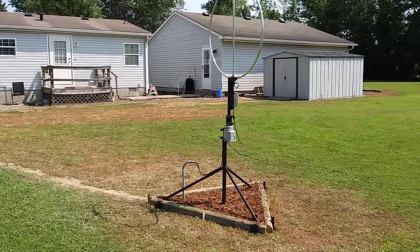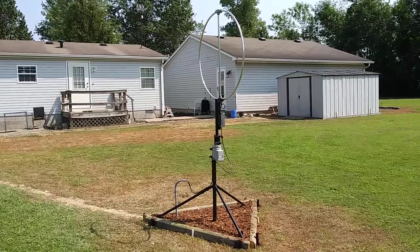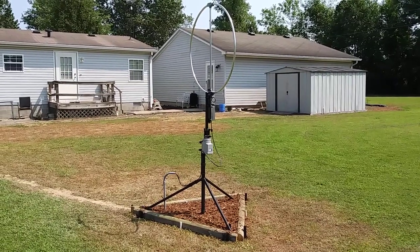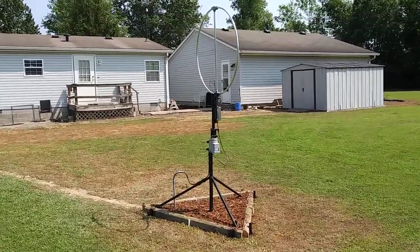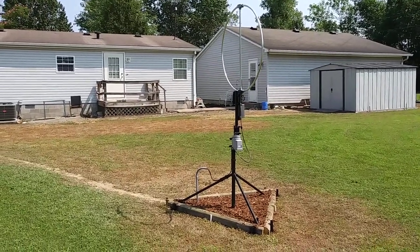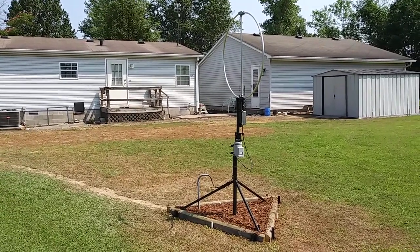It works really good. We'll do a video and I'll show you how it works against some local interference. I'm surrounded by 1,000 acres of farmland — they've got big green bins over there and I get interference when they're running the dryers and all that. It's a raspy sound. There's also a farmer down the road with solar panels and what I think is an electric fence. My big Alpha Delta antenna picks up noise like that from a mile away easy. This loop cuts it completely out, and without much signal loss. I'll show you that in the next video.